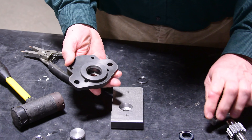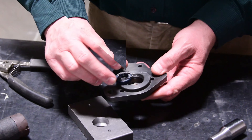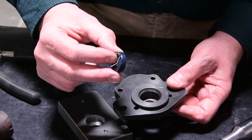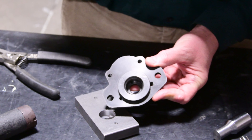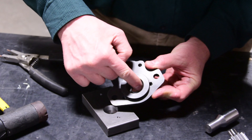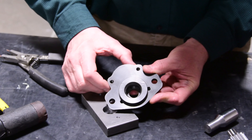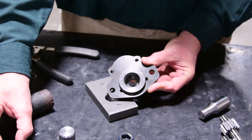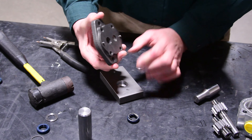In order to reassemble, the housing is required to be properly cleaned. Once the old seal is extracted, it is important to inspect the housing to make sure there is no scratch in the location where the new seal is coming. It has to be scratch-free, otherwise the new seal will have a hard time working properly.